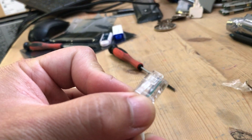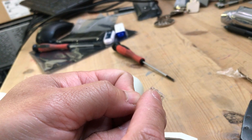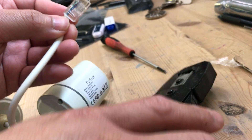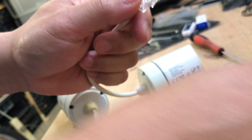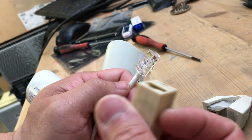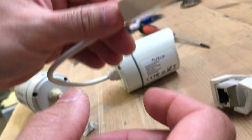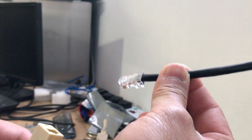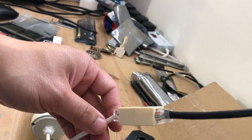Double-check on the back — the white one is in position, and positions seven and eight are left empty. Then clip it in. If you want to use a connector on this one, you need to buy this copper clip-on piece — you just clip it on here, then connect the network cable from the DVR device and clip it on, and it will work.